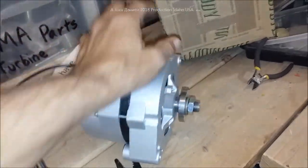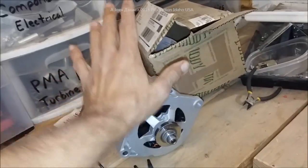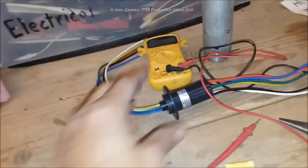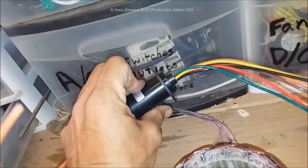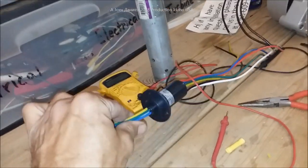The Thermodyne turbines — they work great. This Thermodyne right here has been up five and a half years. The Chaos turbine and the gray matter turbine have been up there too, but I've got to replace the gray matter's slip ring now. I get these slip rings from Hurricane Wind Power. They are Moflon — Moflon is the right brand. These here come from a place out of the Midwest and are Vietnam-made knockoffs of the Moflon. Both are around $20 something dollars.